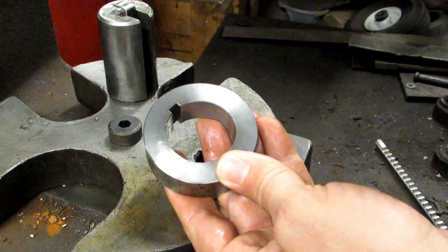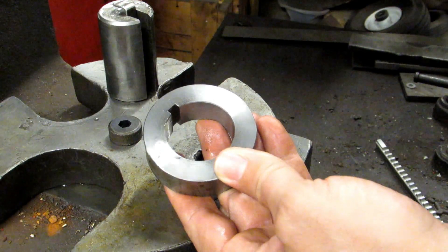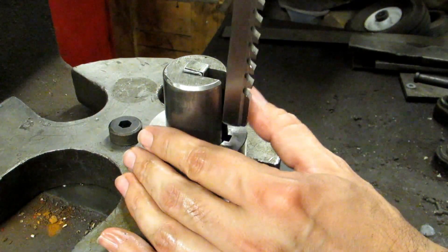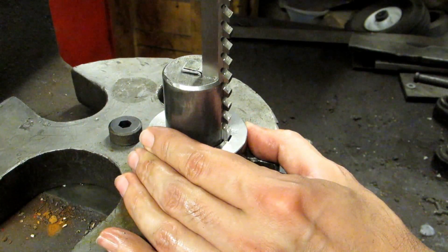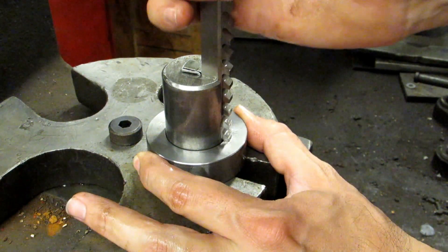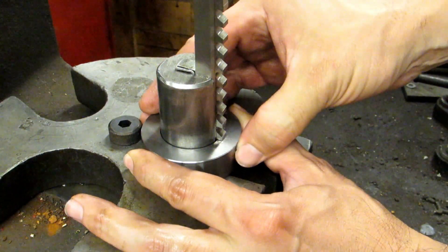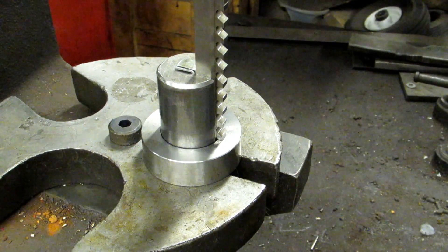Generally you want a little bit of extra because you want to make sure that that key is going to clear. So I'm going to put in a really thin shim and push it through one more time. With this thin shim you can see it starts about halfway down the broach so you really don't have to move very much at all, and you still want to use a lot of oil though.